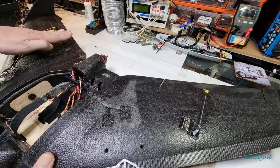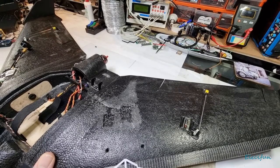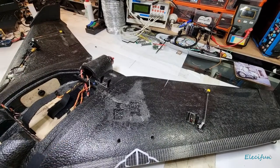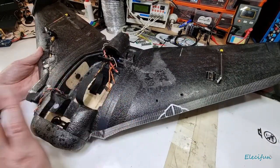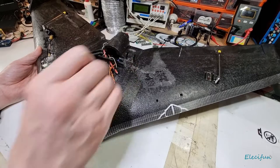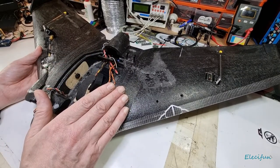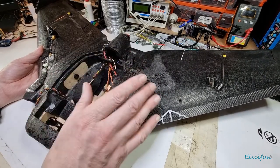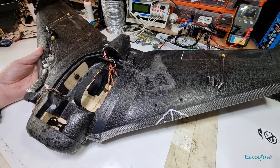The amount of travel you want up and down is about 12 mm in each direction. But you'll probably set that up within your software just to make sure you've got those limits. I never bother, because I use INAV, I just select, which is what I'd advise anyone to do, the closest size to the frame. For me, I think it's the Z84, because this is 900mm, the 840 is 840mm. So I use that setup for PID tuning and everything. I don't have to mess about.